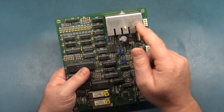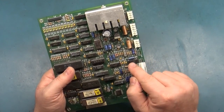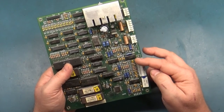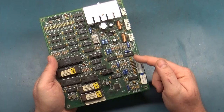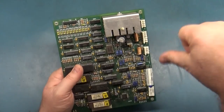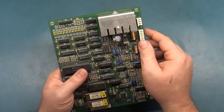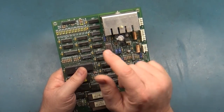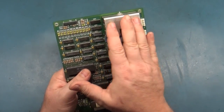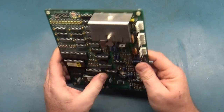So we know the amplifier was running. There are two op amps on here, the TL084CN at U33 and U32. So if you have low volume, you could have a problem with either one of the op amps or both, or the main amplifier. If it's ice cold, your main amplifier is dead. If it's lukewarm, fine, but it should never be hotter than lukewarm. If it's hotter than lukewarm, something else is overdriving it, which is usually the capacitors, and I'll get to that in a moment. But if you have no audio at all, and this is lukewarm, then it's most likely one of the two op amps. But anyway, that's a separate issue to what we have here.